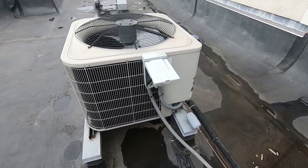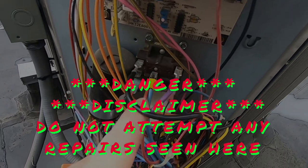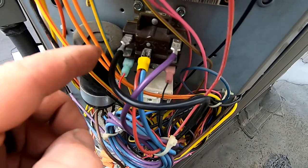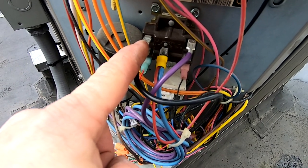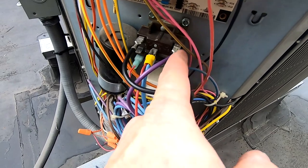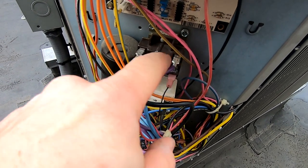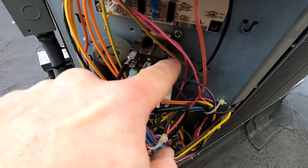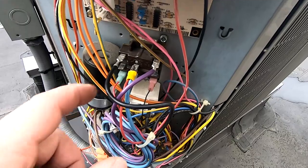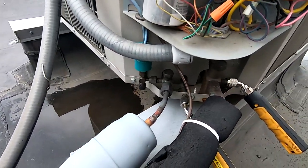I've got a heat pump here that was freezing up. They've got a low ambient kit installed. Power comes in from the board, paralleled with the pressure switch going through the normally closed contact to the common of the fan. The other side of the fan cycle switch comes through the normally open, so you're feeding power both ways, with the fan motor as the end result. The fan motor is powered either through the pressure switch or energized directly when cooling is called, and otherwise through the normally closed contact so the fan runs in heat mode.